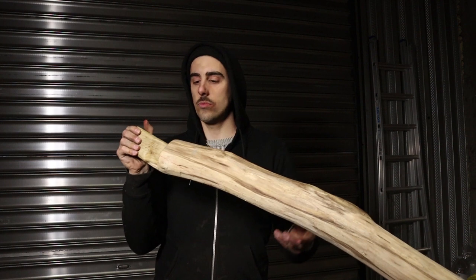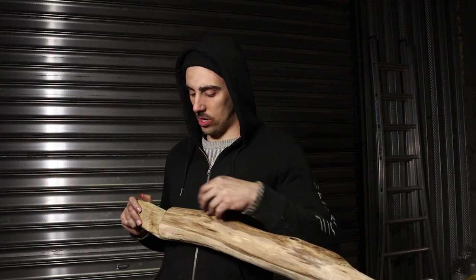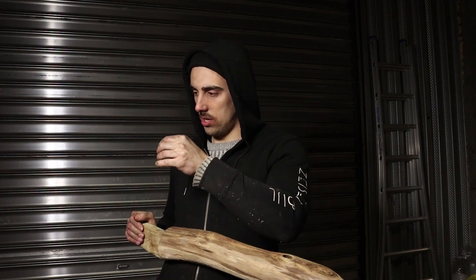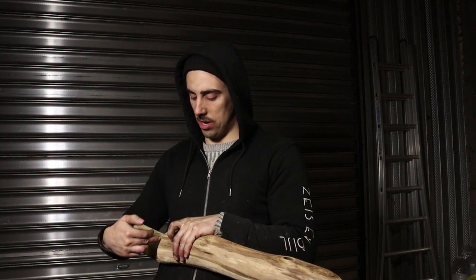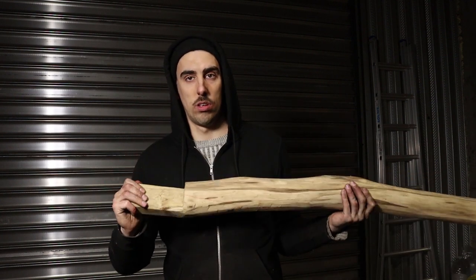Another difference is that you look from the top instead of from the side. So what you need is a pencil with a big flat side that you can hold against the plumb line. So you drop the plumb line down and align it with the shoulder line on the floor. And when this is correct and your piece is still level, all you need to do is put the flat of your pencil against the plumb line and scribe it off on the curvature of the wood. So then you should have a pretty good projection. And this eliminates the error of looking from the wrong angle, projecting your line somewhere where it doesn't need to be.